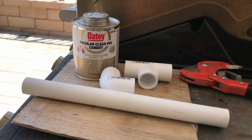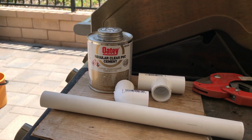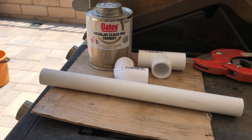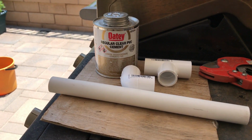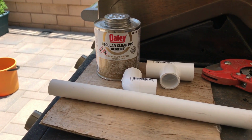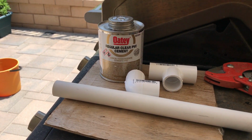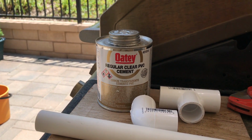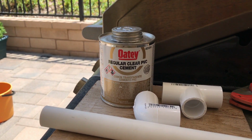Alright, I've got my pipe cut that I need that I'm going to come up from the ground with. I'm going to go from elbow to this 12-inch pipe that I cut into a T. It's going to tee up to go to the valves, and then the other end is going to go up to a faucet so that way I can hook a hose up to it. But here is the cement that I'm using. I'll put a link in the description.